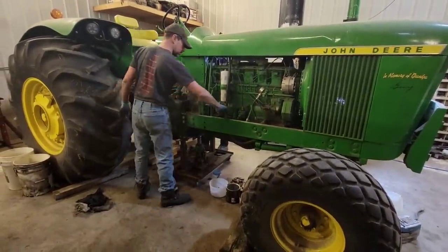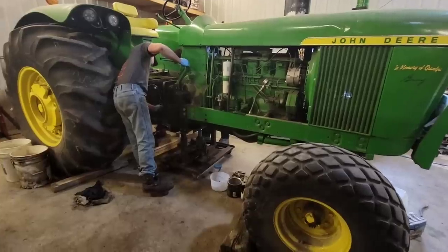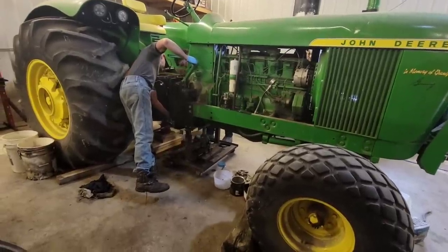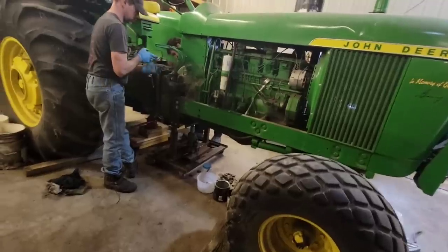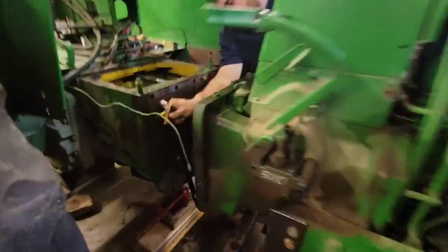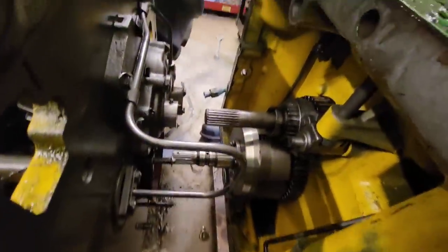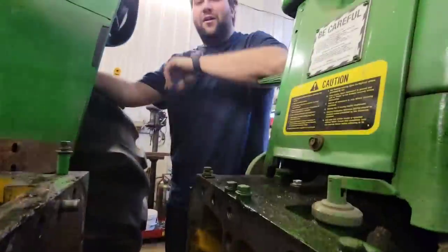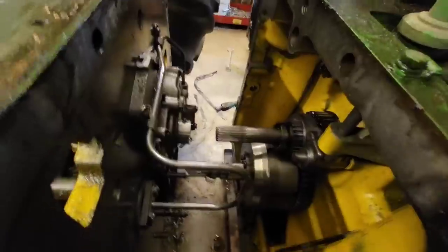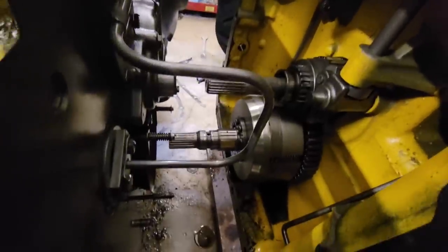The gasket's no more good. Drop it down. Would you just look at it, Amanda — would you just look at it? What are you looking at, Amanda? I don't know. You know what that is? That's your PTO clutch — your PTO shaft and your output shaft. PTO is down here? Yeah. You've got oil leaking anyway. That's your PTO and that's its clutch pack, and this is your output shaft.